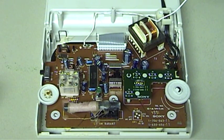The input for that audio amplifier is brought out via a pin on this integrated circuit. So if you were to cut a trace, install a switch, and install some sort of a mini-jack, it would probably be possible to add a line-level audio input to this unit. Then you could hook up a CD player, a tape player, a phonograph preamp, an iPad, an iPhone, or whatever kind of music player you would like, as long as it has a roughly line-level audio output.